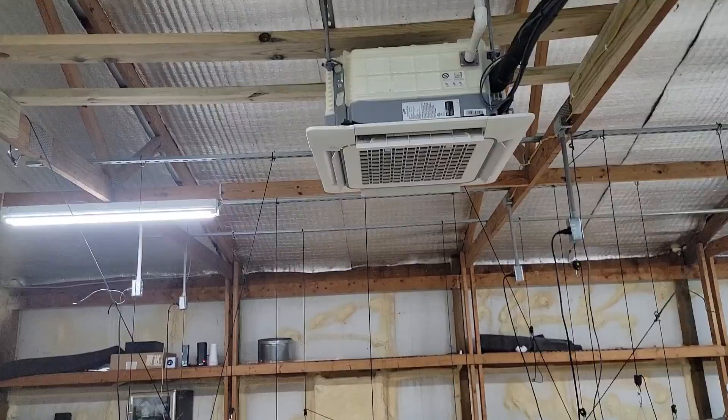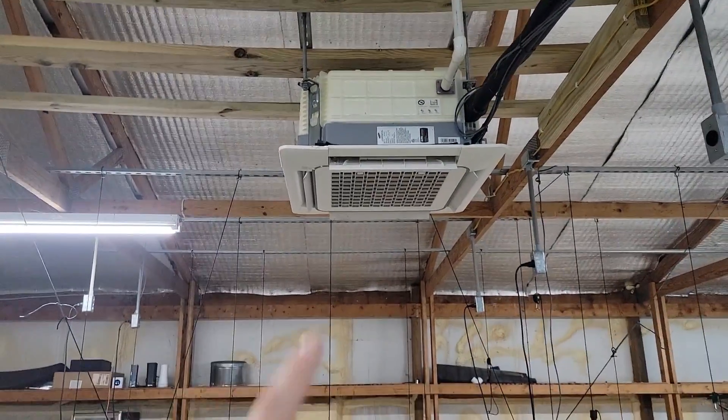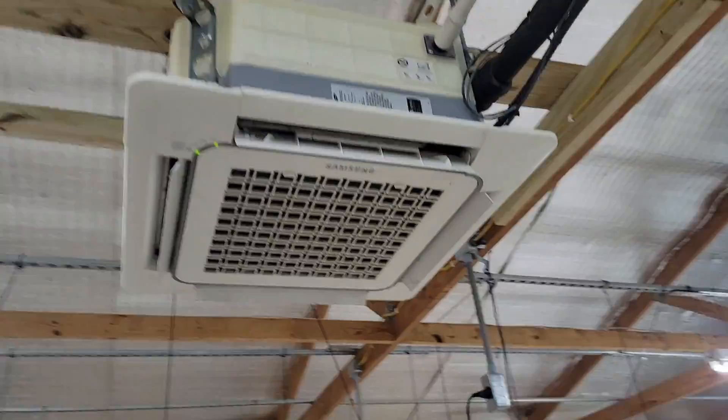Make sure you have plenty of ventilation. Above a drop ceiling I've never had an issue. This unit is 24 by 24, so if you're going to install a mini four-way cassette made by Samsung, it will fit perfectly in a standard drop ceiling tile. The larger cassettes — like the 2-ton, 3-ton, 4-ton 360s and 4-ways — are 33 by 33 inches. When you order a fascia panel for a 360, it can be round or square.